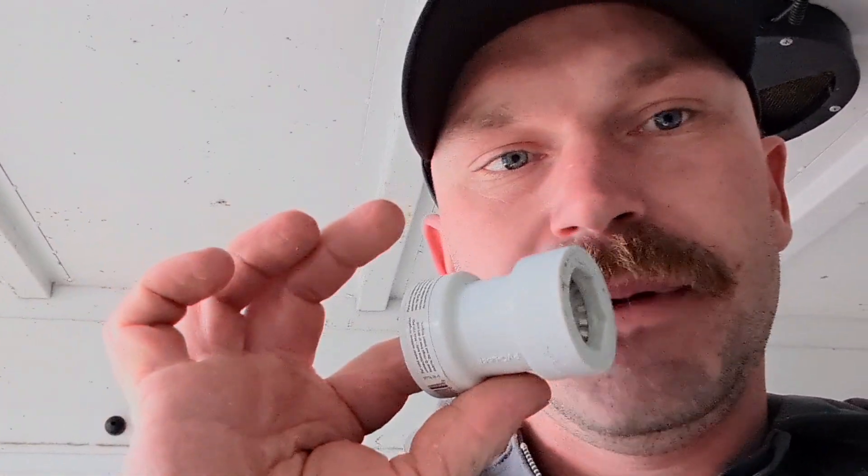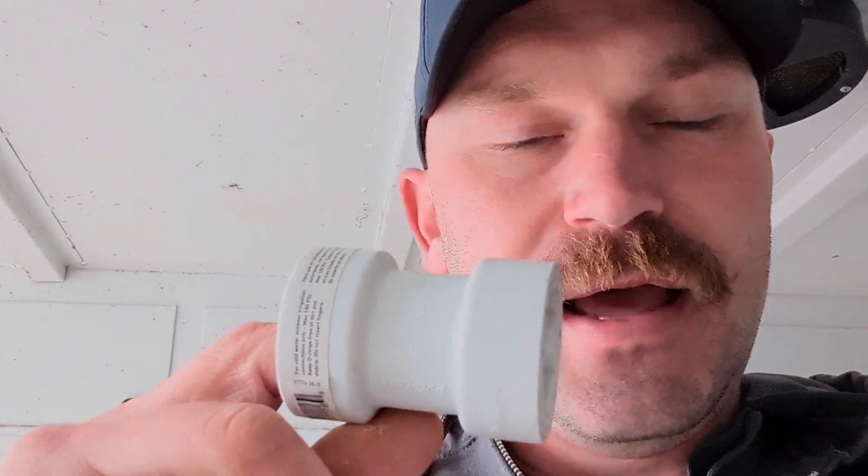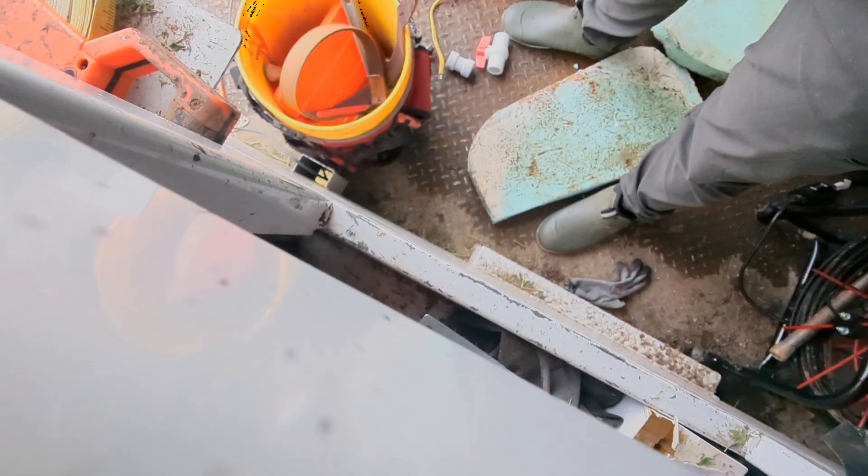We're gonna do a live repair on a PVC irrigation line in a pinch. You could use this on live water, but they're meant for irrigation only, so we're gonna put a valve on so we can put it on while it's under pressure and then turn the water off without shutting this entire mobile home park down.